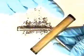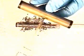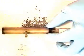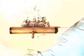With the bending rubber inserted into the vacuum jig, attach the syringe to the vacuum jig via tubing. This will apply the vacuum necessary to pull the bending rubber into the vacuum tube. Carefully slide the pressurized vacuum tube with bending rubber over and up until the insertion tube joint.